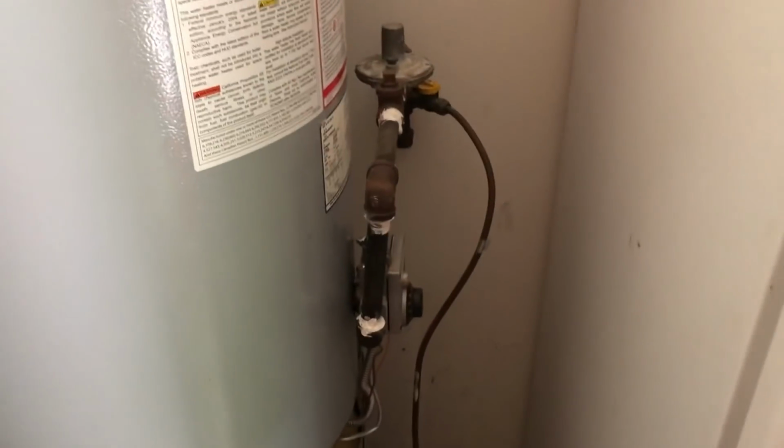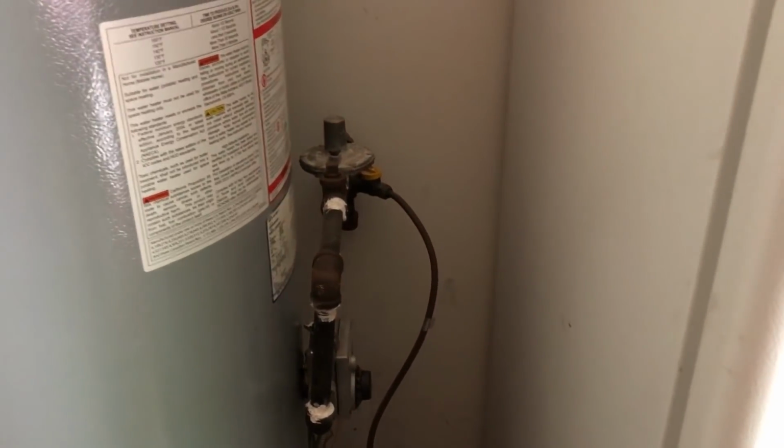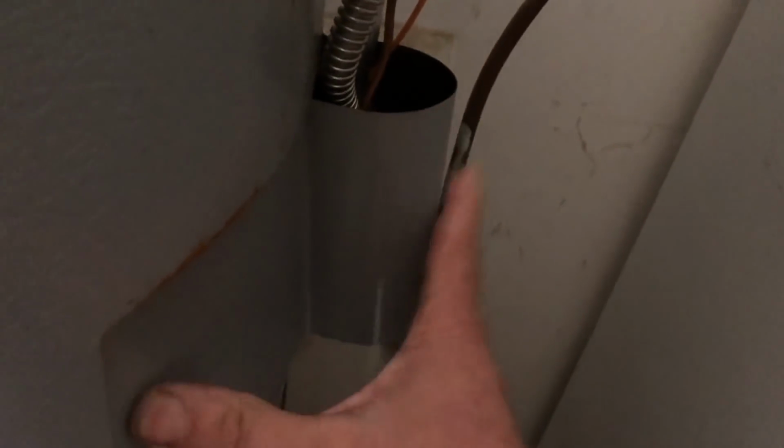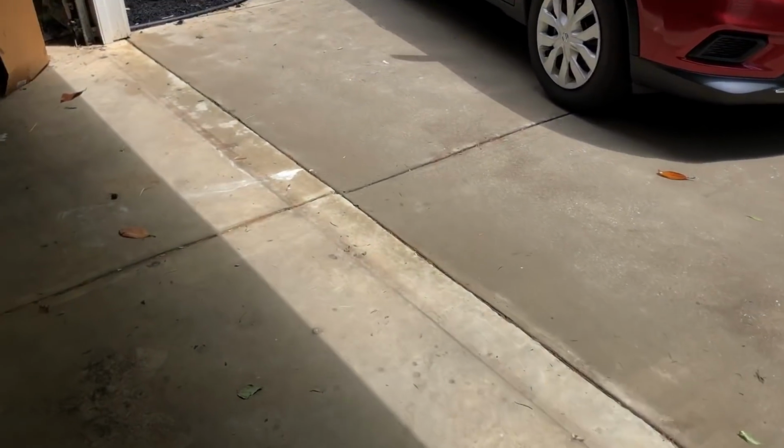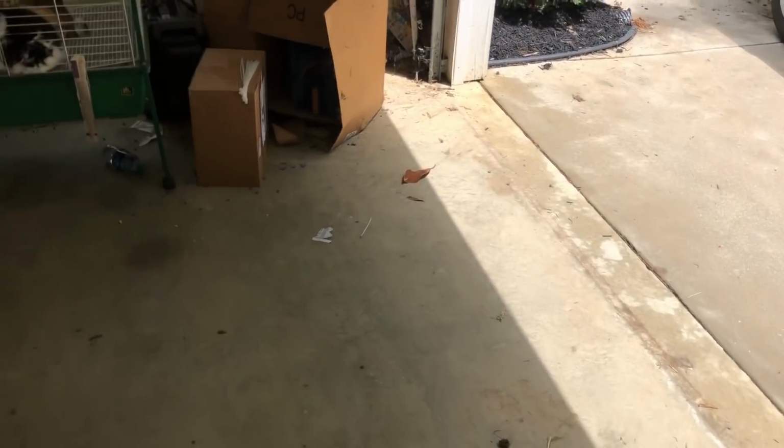I did clock the meter for about 10 minutes on its little half foot. Doesn't have a quarter foot on it, it's got a half foot dial. And it did well. Take both hands to get that on. It did not move in about 10 minutes. And I'm going to go under there and soap our flare and our fresh fittings. And we should be good to go.